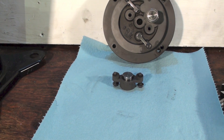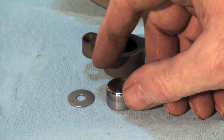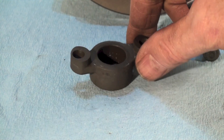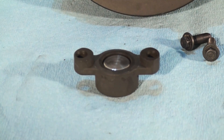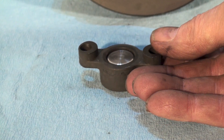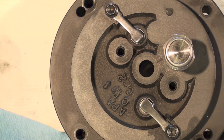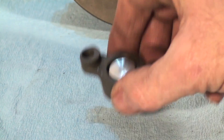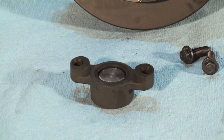Let's see how this thing is put together. I've got it apart here — this just simply fits like this, a little washer goes in there like that, and this is just a solid steel piece, like a little short piece of shaft. When pressure comes up here, because the gases are coming through the center of that scroll, they actually push that valve open so it moves down and allows the gases to go out the side. It's a valve.